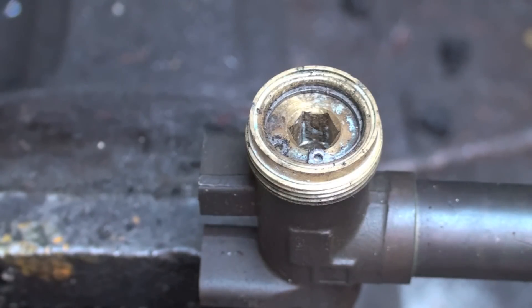Pressure this up — I would be pressuring it up with nitrogen or CO2. Get your pressure up to about, depending on what type of unit it is: if it's a 410A unit, I'd pressure it up to about 400 pounds. If it's R22, you're not going to pressure it up quite as high. Take a look at the model and serial plate — there will be a maximum pressure, low side and high side. Don't exceed the maximum pressure for the low side when you're pressure testing. Some of those are as low as 150 pounds on the older ones, so you need to watch that.